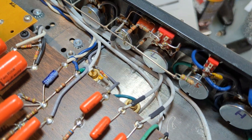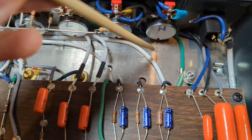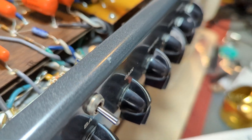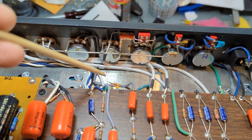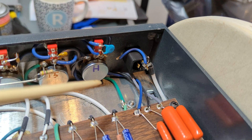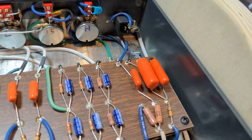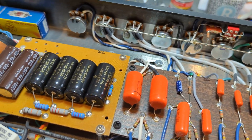On the reverb, interestingly they are using isolation jacks, which is cool. Really great powder coating — you can see the little flake in the powder, it's beautiful — whereas the other ones are just a flat black, so that's a differentiator. The aluminum looks really nice, high quality aluminum jack, really nice for switching and making that a grounded input when it's not plugged in. Really cool stuff — Nichikon cathode bypass caps, if I didn't mention that before.